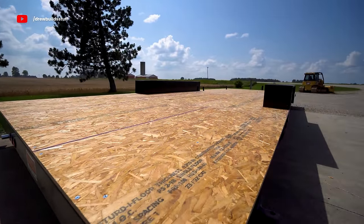And then I'm not going to go into a ton of detail on installing this light because I'll do that more on the next video where we start closing in the inside and I go over all the electrical. But basically I just popped the light into place and then cut this bulge of wire I had just run through the framing here. And then I just stripped each of those wires back about 1/2 inch or so. And then it's pretty simple to connect this. You just connect all the wires with these three-way wire connectors, all the black wires in one, all the white wires in one, and all the ground wires.